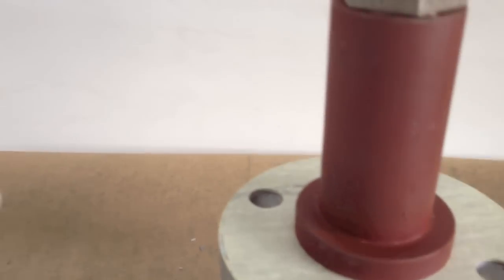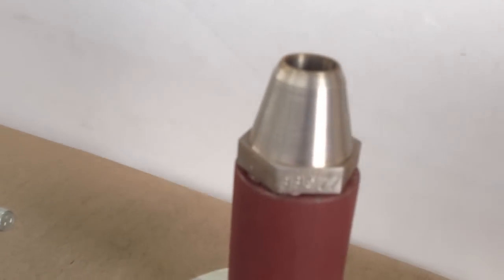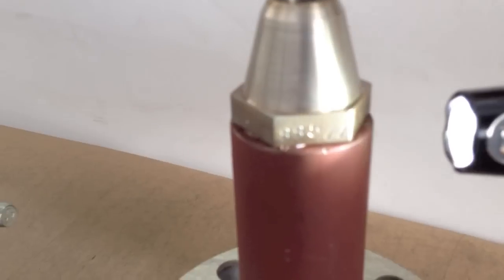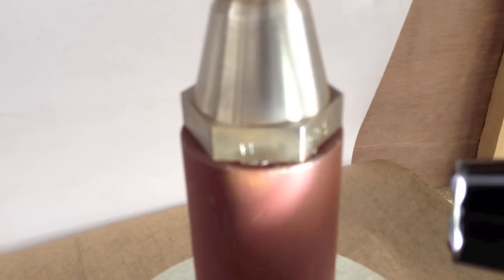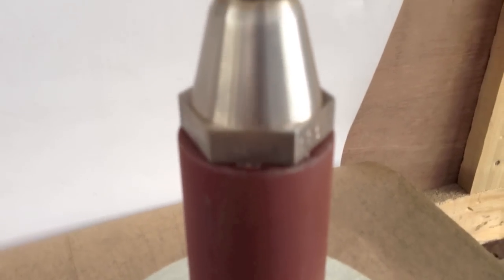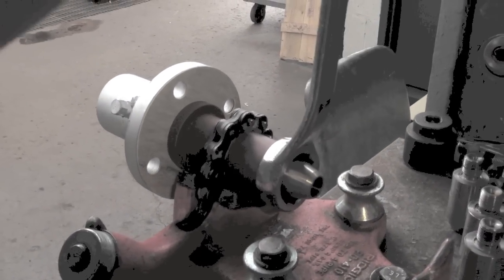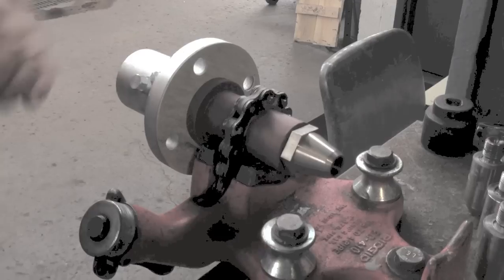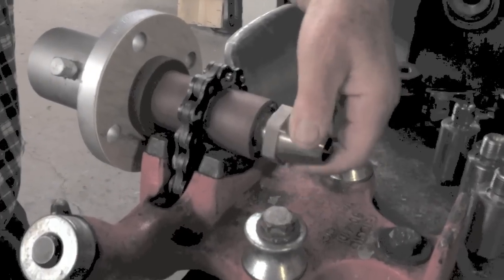This is the steam chest showing the gasket and the steam nozzle that is threaded into the steam chest. All Kroll Reynolds steam nozzles are engraved with the distinctive job number for the part that is ordered. All steam nozzles are custom-built and records are kept at Kroll Reynolds Company dating back to 1917. The steam nozzle is threaded into the steam chest. To remove it, securely hold the steam chest and then untighten the steam nozzle.